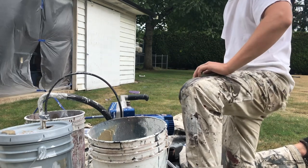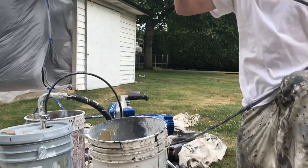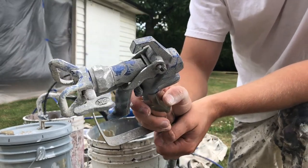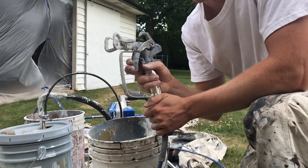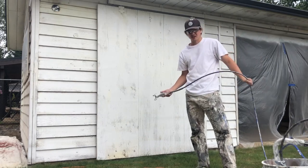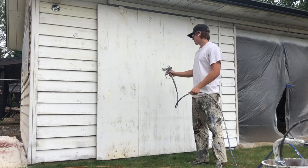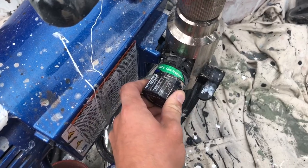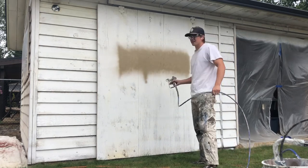Two coats is generally recommended for an old building like this. Another tip: you always want to put the safety down — right now it's ready to spray, but I don't always want it to spray, especially if I accidentally click it — so you can put this down and it prevents me from pressing the trigger. Now I'm going to turn the pressure up on the machine, because at low pressure — just at the end of the gray scale on the dial — it comes out pretty weak.